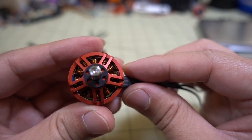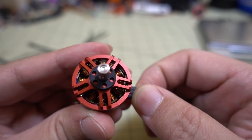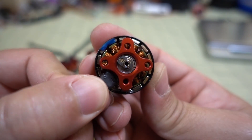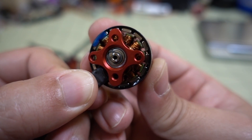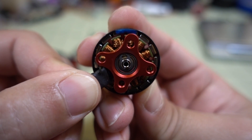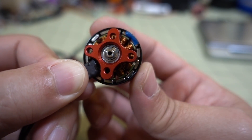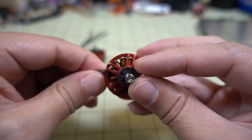Taking a quick look at the motor — it's a decent looking motor for a budget motor, nothing super spectacular. You've got some standard, pretty flat magnets and a pretty wide air gap. The windings look pretty thin, and there's a C-clip on the bottom rather than a set screw. It looks like it has a hollow shaft.